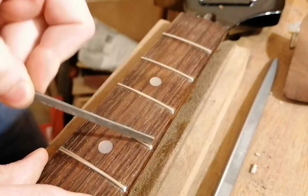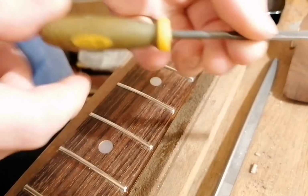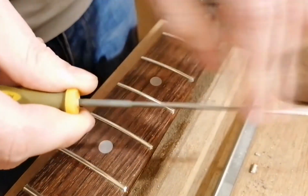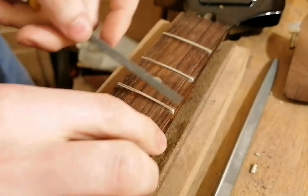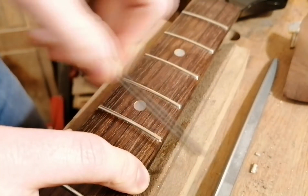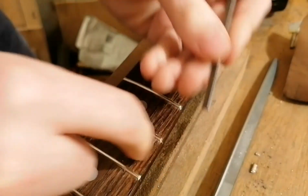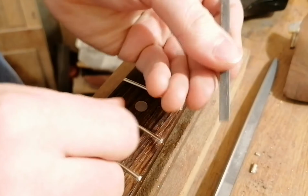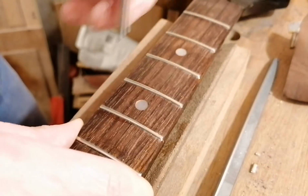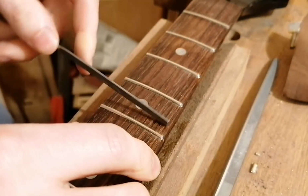And it's really quick, so if you have sharp fret ends, just get yourself a cheap little needle file. Spend the day taking the edge off it, and then work down your sharp fret ends. That's if the crown is sharp. If the tang is sharp and like a Fender neck or something similar with no binding on it, you can still use the flat side and get in very carefully, but you need to be very careful not to get the file in the wood.